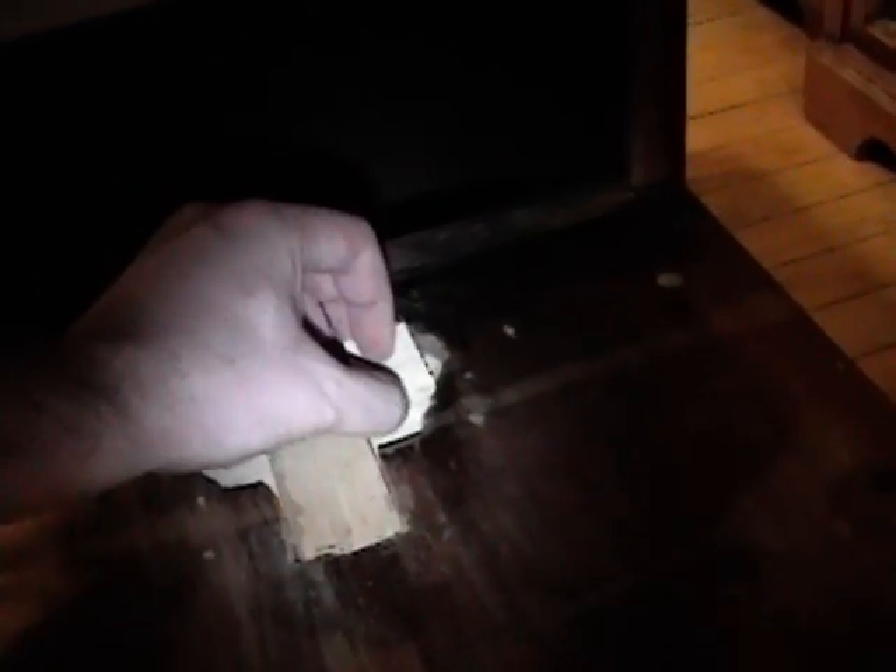I ended up changing my tactics slightly. I put a piece of wood across the bottom and screwed it in from below and glued it as well, so a nice strong patch. Instead of cutting and tracing around here, I cleaned up this part a little bit and then just took a piece of oak and put it in like that, with some scraps on either side. That's a lot quicker than trying to trace around with a coping saw. I'll fill in the voids with that wood putty. I also discovered that there was originally a piece of cross bracing underneath the shelf going across here — you can still see the old screw holes. I'll be cutting out a piece of square stock that spans that distance, cutting it off, and screwing it in from below to fill in that last inch or so.